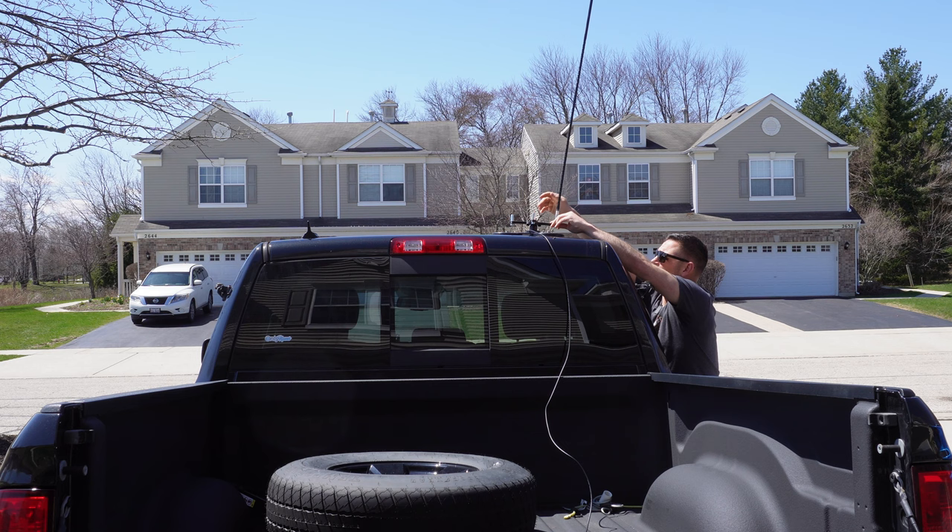I should probably tighten this nut in the centerpiece better. Warning: do not do this at home. You can see it's bending already — that's an indication you don't want to drive down the road with this or use it in high wind situations, because if it breaks it could harm somebody or cause damage. You could correct this by using a stronger infill or a better filament type. In my case, I'm going to order nylon for the base plate, which will be a lot more durable.